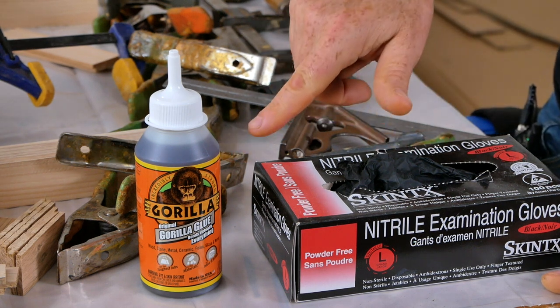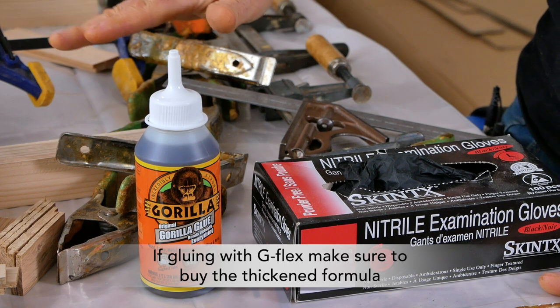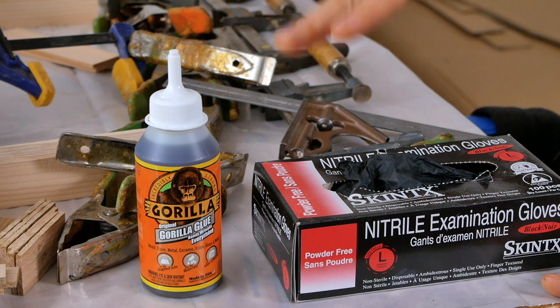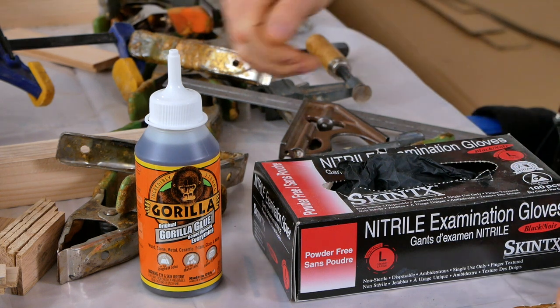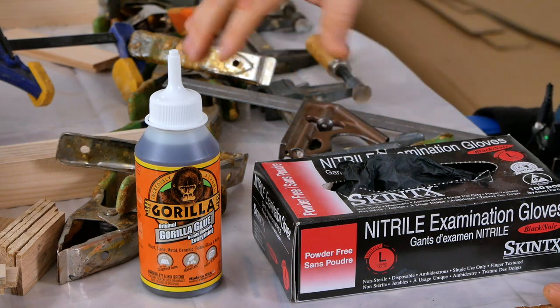Other people that are a little bit nervous about the gluing strength of Gorilla Glue will go for something even more hardcore like a gap-filling epoxy like G-Flex, and that will certainly work for the job, but you have to keep in mind that G-Flex is extremely expensive and it's also very toxic. So if you're going to work with it, you need to have good ventilation and a respirator. On the other hand, there are situations in which I think G-Flex makes sense - specifically if you're working with pieces that aren't very smooth so they don't have good gluing surfaces, or if you're going to be using an alternate clamping method where you don't have good clamping pressure, like wrapping this in bicycle inner tubes as opposed to using bar clamps. In that case, I think it's probably a lot safer to use a gap-filling epoxy.